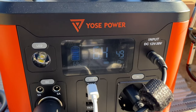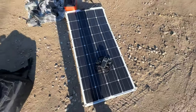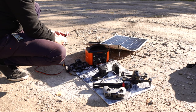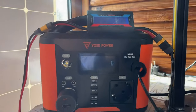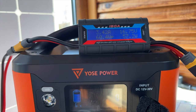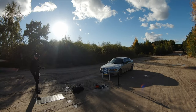The best part? The whole station cost less than two extra DJI Avatar batteries. It has a 60-watt USB-C port, so quick charging fully tops the Avatar battery in about 30 minutes. And this is not a launch pad — it's a solar panel. A 100-watt panel can recharge the whole power station in about 6 hours of sun. On an average day I get around 60 watts from the sun, so a 100-watt solar panel will top the power station in less than a day.